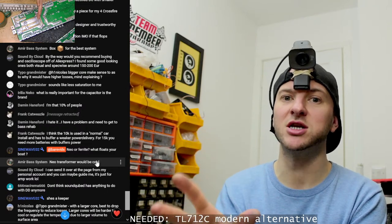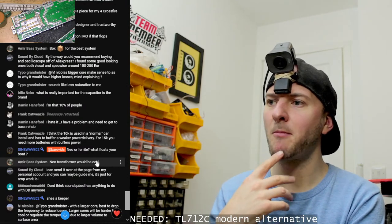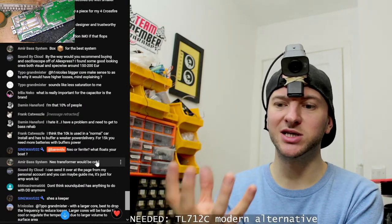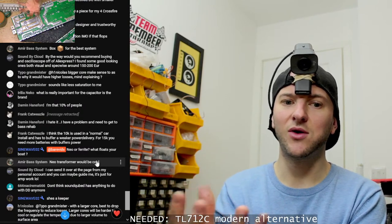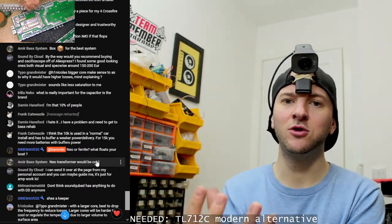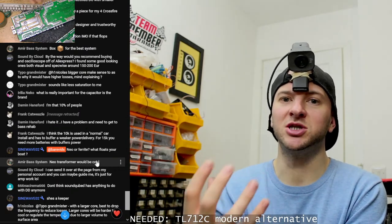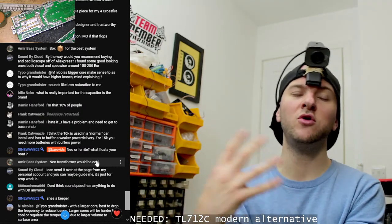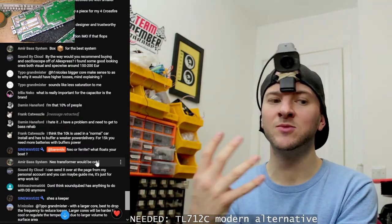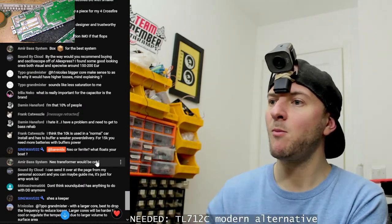The temperature point at which Neo starts to degrade is much lower than ferrite, much lower. Also, with Neo, there's less physical mass there to act a bit like a heatsink for the coil. A Neo motor will get up to temperature much quicker than a ferrite motor will, which does, over time, especially with long demos, affect the cooling performance of the coil. So, yeah, swings and roundabouts.